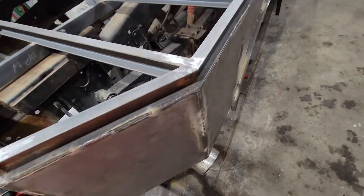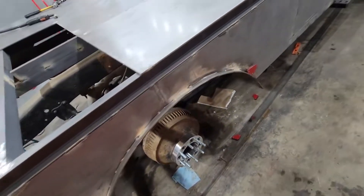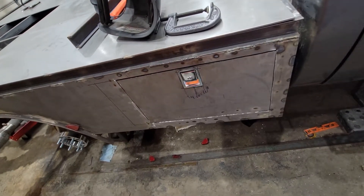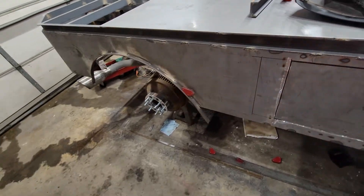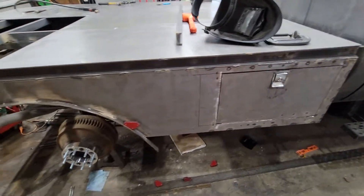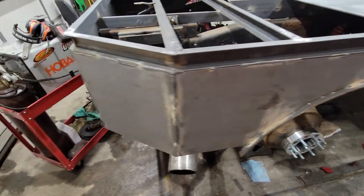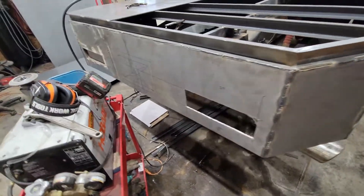Built the whole thing out of quarter inch cold rolled steel. Cold rolled is nice — kind of clean, because there's no mill scale or anything. When I originally built it, my sheets were 57 by 57, so I cut them all down. This is all just one sheet — no cutouts or anything.